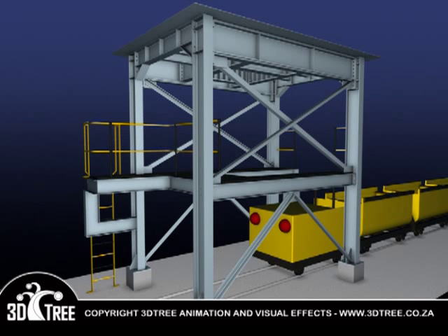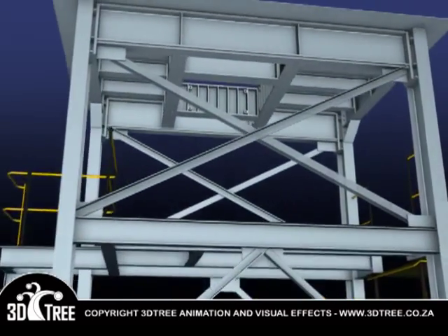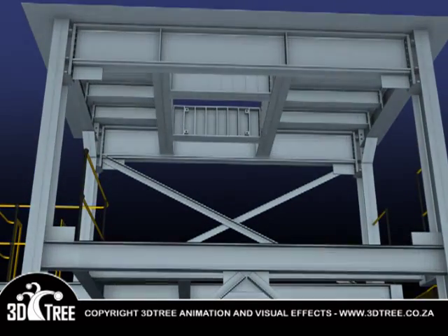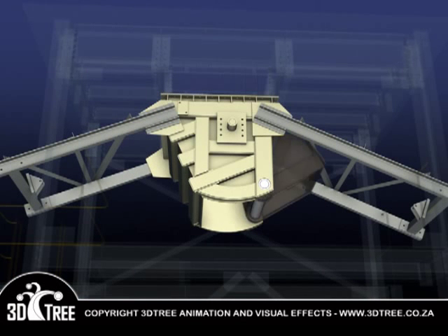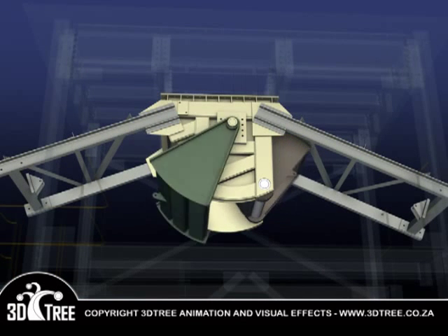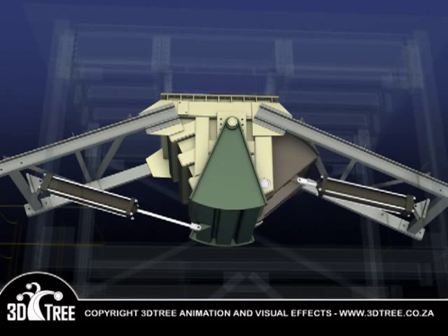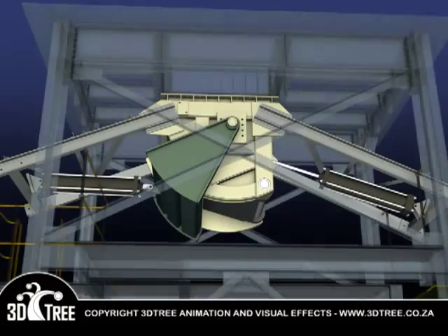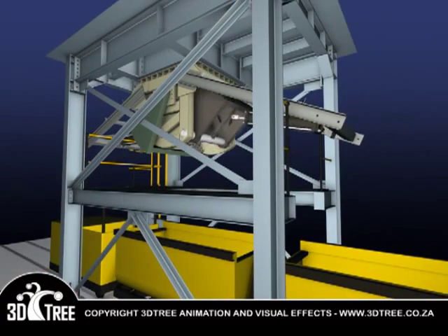The Spilminator MK4 hanging wall chute fits into the standard bulkhead installation, attaching the chute opening to a hanging wall or ore pass. The chute consists of a double door setup — a primary door and a secondary backup door. The pneumatic-driven doors are manually operated, controlling the flow of ore into the hoppers below.